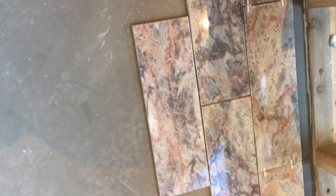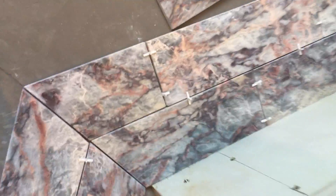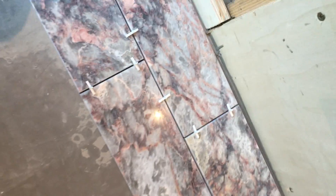We got started on our floor tile. Right now we're dry placing a border tile. There's a double border that goes around the main bathroom area, then a staggered running bond pattern. This main room has a double border that turns to a single border here, and then it meets up with the linear drain in the shower. The glass line is sitting on this grout joint on this side, which separates the shower area.